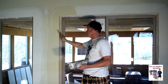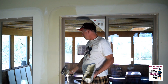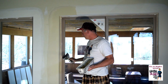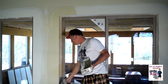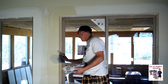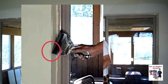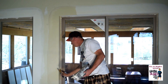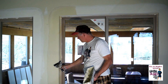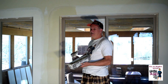In the interest of speed I like to do it one time. I'll show you a close up — the final result. It's nice and smooth in there. And then because the mud rolled over like I said, you almost always get some that rolls over. So after you've made your final wipe, take a little bit of that off so that it doesn't roll back onto the inside.